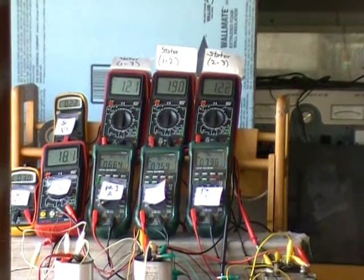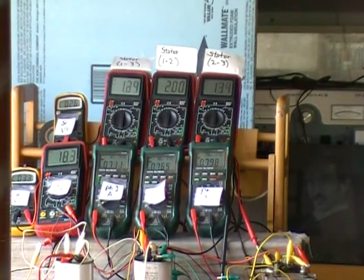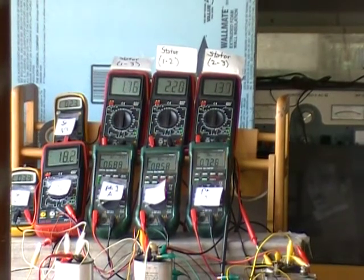But nevertheless, that's leveled out there. We have demonstrated that. Now we want to go on to the scopings. We're going to turn the field back off again. But we do need to mention the fact, well, we can do this with the full field. Right now we're at 2 volts per division. And we got 0.8, 0.9 amps. A very fluctuating amperage on those phases there.